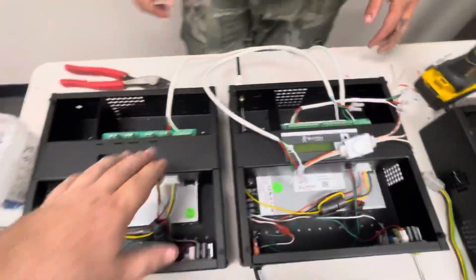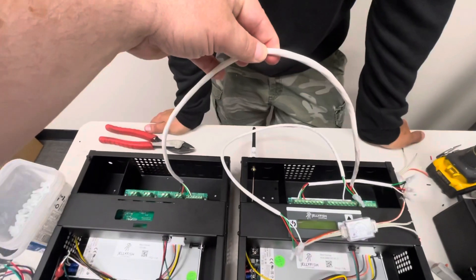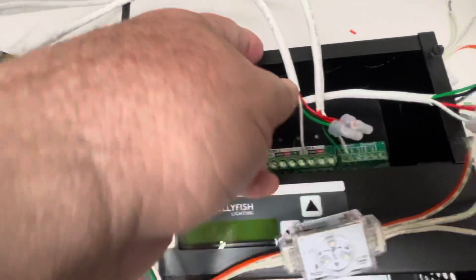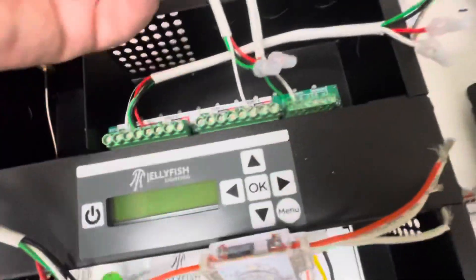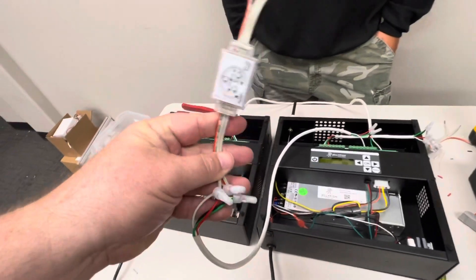So if we were reviewing this, you're actually using a standard 16-4 here, but kind of dual purpose. You're using the green and white wires to connect the two boxes together. And then you're using the black and red as your ground and your power to tie the line out to your lights. That's where you're drawing your ground and your power from — the secondary power supply. And then your communication is jumping out to your light, just like you connected it to the last one.